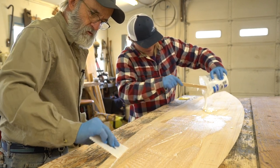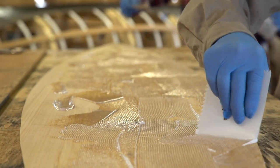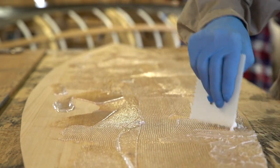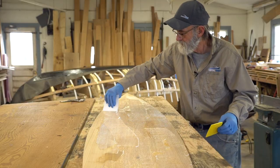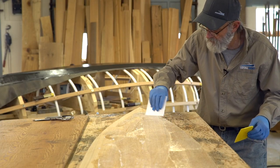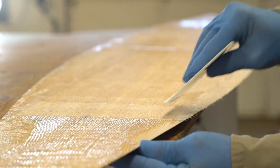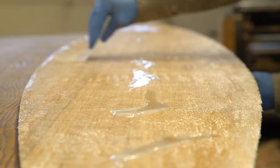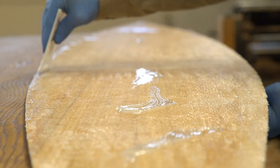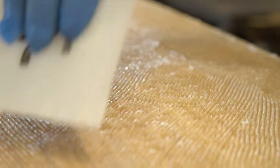Joe is now over at the table spreading thickened epoxy onto the second layer of bottom planking. I'm going to switch over to a tooth trowel to spread the thickened epoxy because there's just no other tool that spreads it around easily and gets the same amount everywhere. I can go up and down the middle and get the same amount, and pull it towards the edges without making a mess. The reason I've thickened the glue is to make absolutely certain I've got contact between the carbon fiber, the first layer of bottom planking, and the second layer of bottom planking — ensuring no voids or problems.